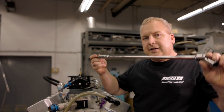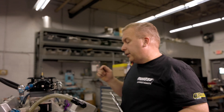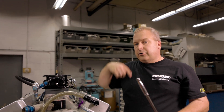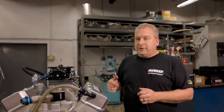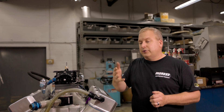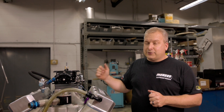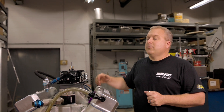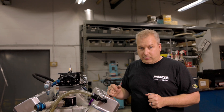Please take the breaker bar off the engine — whether you're doing this or on a blower motor — because when we put air in this thing, if it decides to turn over, this thing will go right through your head. We don't want that happening. As often as you've seen me on these videos, you've also seen our 582 Dyno Mule. We're using this today to show you how the leak down tester works. We did a little pre-fitment before, and the one cylinder we're going to show you now is not spectacular, but we're not here to talk about the condition of this motor — we're here to show you how the leak down tester works.